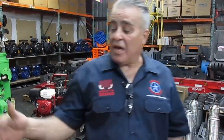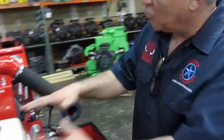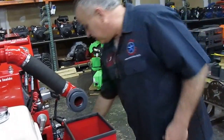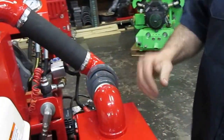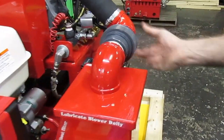But if you happen to leave the fuel valve on, you might be driving down the road and the needle in the carburetor might start bouncing and get stuck, to the point that it starts draining some of this gas into the engine oil, in which case the engine is going to need an oil change. Now, if you notice, I waited until I shut down, cooled off, lubricated, dried out, everything was done. Then after the machine was shut down, I simply put the filter back on.